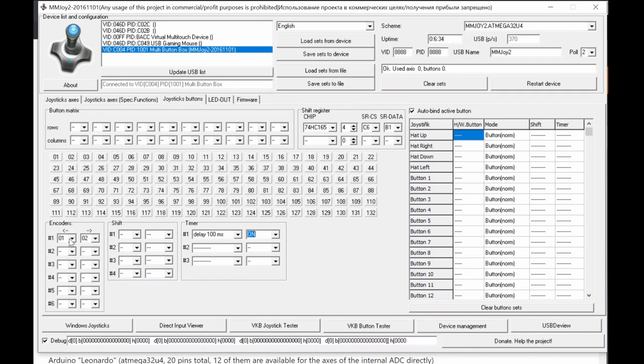You can set up multiple encoders — for example two encoders each with left and right buttons. To program an encoder in the special functions tab, you double-click a button slot and assign it as an encoder. It gets assigned to a timer — Timer 1 by default — and you can change to Timer 2 if needed. Each encoder occupies two function button slots.